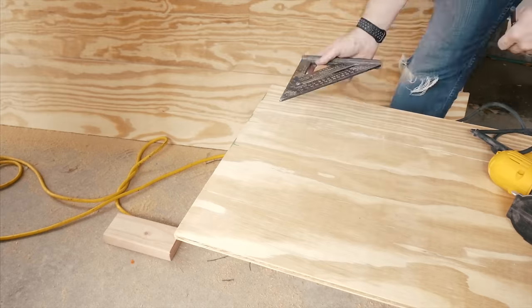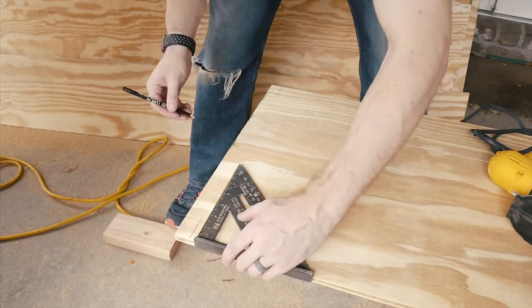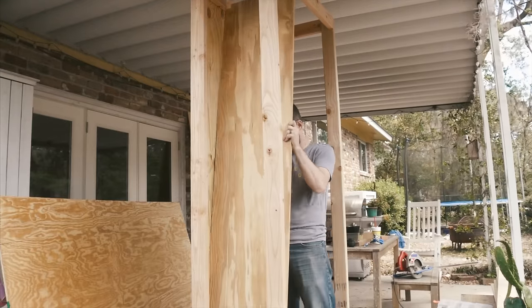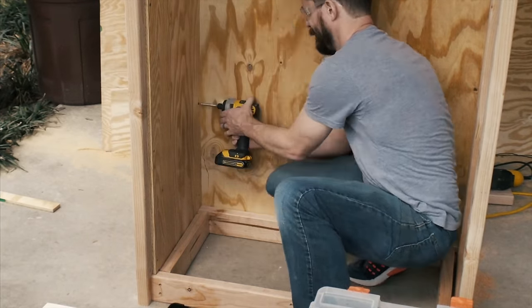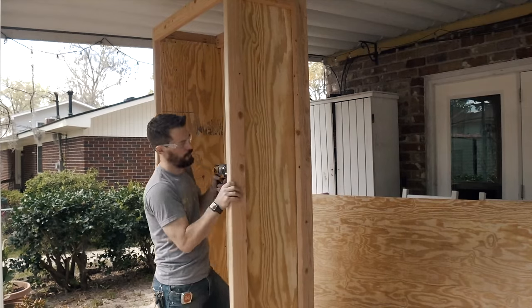I cut down a few more panels to fit into the sides. These are pretty basic — the only difference was that I needed to notch out to go around the 2x4s. I used my speed square just to mark out these and then cut them out with a jigsaw. This extra little bit on the end helped it to drop down inside the frame to make sure that there was a connection at the top and the bottom. This held the panel in place and I just added some screws into the back of the 2x4s. I put the other side in the exact same way.